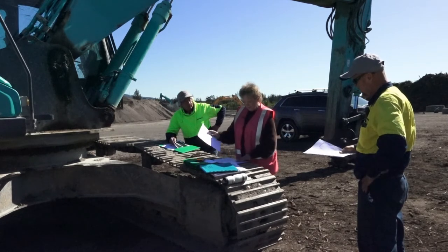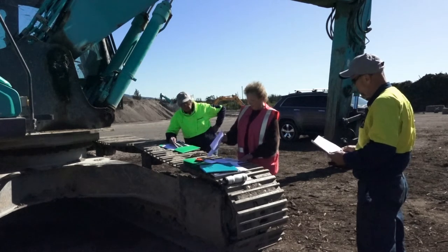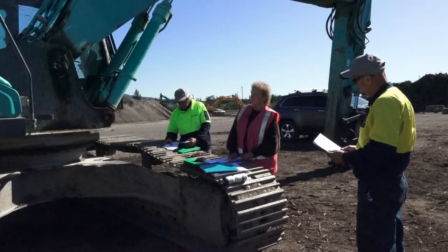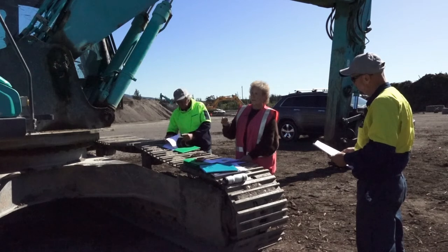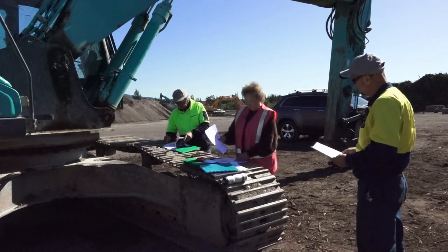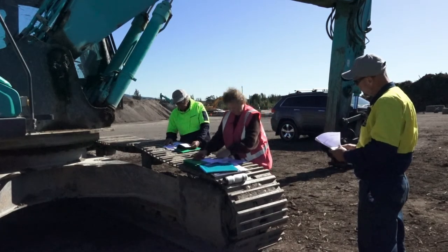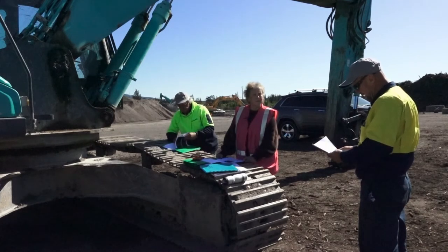Just when you're passing through the training material here, you'll find that it's very, very important to have them vented. If we were to put hydrogen cylinders into a passenger vehicle, it has to be an enclosed box, and the enclosed box has a vent valve. So we need to control the venting. But out in the open, there's absolutely no problem with it. You were saying then that there's no issue with it being in the sun. That's correct.